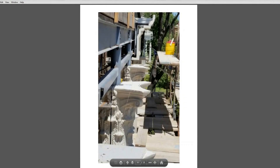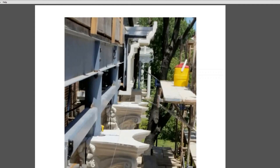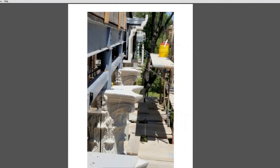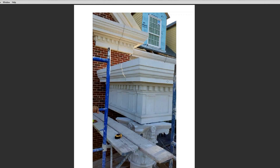Here in this photograph you can clearly see the column capitals coming together and all the structural support - in this case tube steel, though it could be a wood support. You can see the entablature beyond, and you can also see this bearing connection right in front of this column. It's just being held on by a clamp at this point, but that'll get welded onto the tube steel structure. There's that angle iron bearing with a little pin coming up that the GFRC cornice frame will just rest down on, then tie back at the top with that clip.